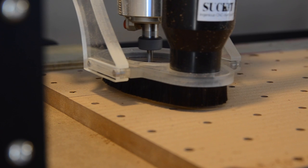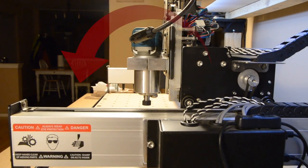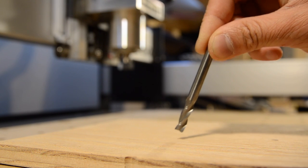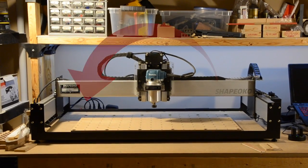This is a step I overlooked when I first got started with CNC, but now understand the value of. Think about it this way. If your spindle is rotated around the x-axis, it's cutting with the front or back edge deeper than the other. Taking passes in the x direction, you'll end up with a stepped texture on your surface. If your spindle was rotated about the y-axis, then you'd leave a scalloped surface when you cut.